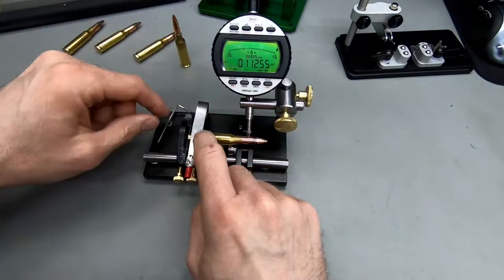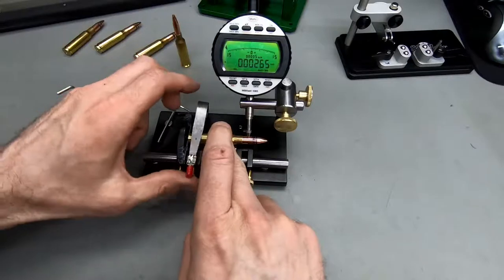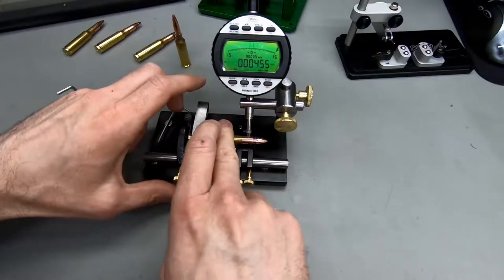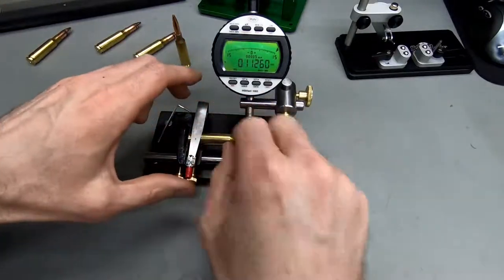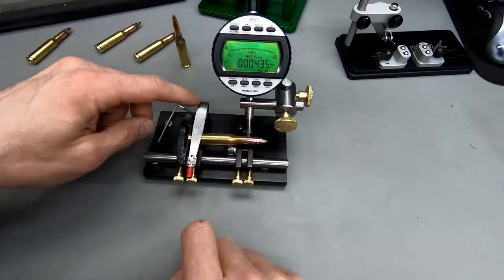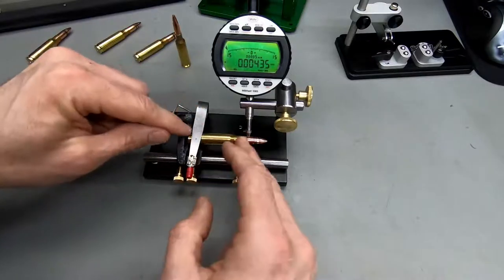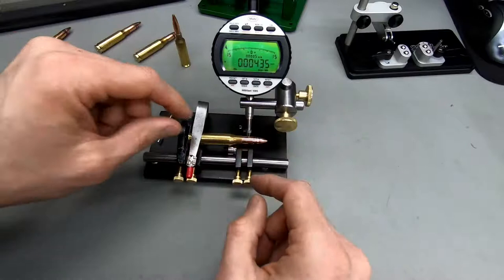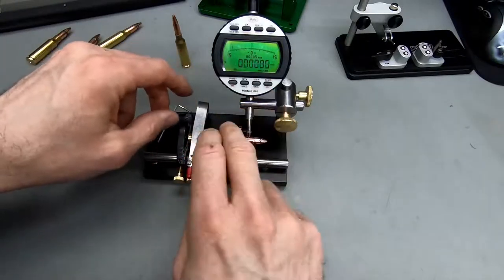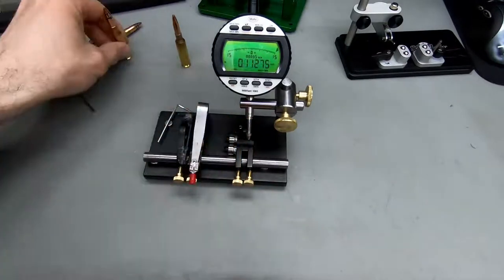I'm a bit uncertain whether this spring is actually helping or making things worse. What's really nice is that this spring kind of holds everything in place. So you can basically do these one-handed twists here. Let's try this. Okay. What I did is I angled the spring a little bit so that it contacts the case a bit behind these ball bearings. Otherwise, sometimes I had a contact in a way that it would tilt up the case, that wasn't good. So I think this is a really nice setup now. I'm gonna zero it, and then you can just use one finger to spin. And that's a really nice way to measure now.